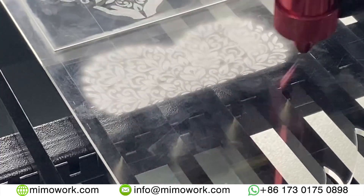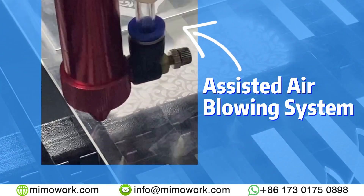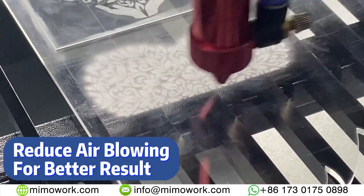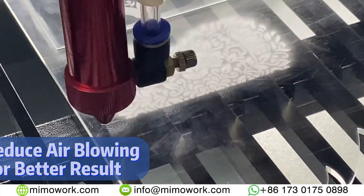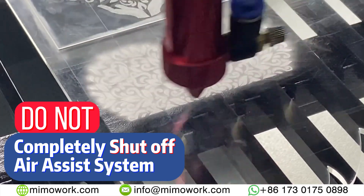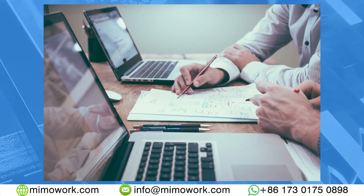In order to achieve the best cutting and engraving results on acrylic, we have to mention the usage of assisted air blowing. Different from cutting other materials, when cutting acrylic, reduced air blowing is recommended for less material formations since it takes longer to cool down. However, shutting off the air assist system is strictly forbidden because it will cause the cutting lens to be easily damaged and might lead to combustion of the material you are cutting.